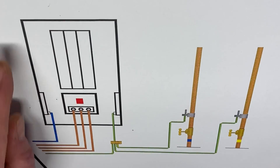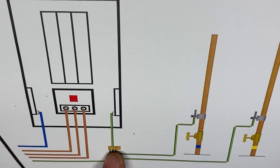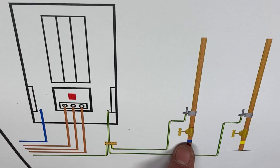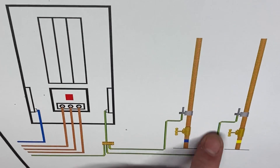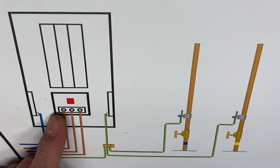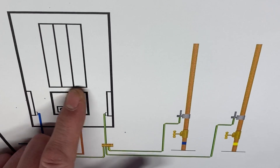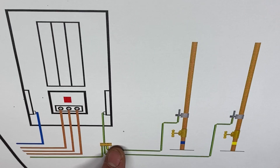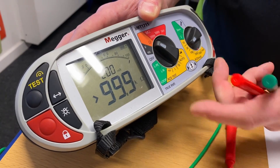I'm going to show pictorially what you've got in your end point assessment. I've drawn here the three-phase distribution board. I've got a separate MET - main earthing terminal - as you will have on your rig, and you will install a new circuit for the protective bonding to the water and to the gas. I've simulated them coming in in metal, so this makes these extraneous conductive parts. We need to test this protective bonding conductor. You must also isolate and lock off the distribution board - I'll leave a link on how to carry out safe isolation with a three-phase distribution board. Once safely isolated, we can start thinking about disconnecting our protective bonding conductors and carrying out the tests. Having set up my multi-functional tester to ohms and removed the resistance of the lead, we're ready to carry out the test.